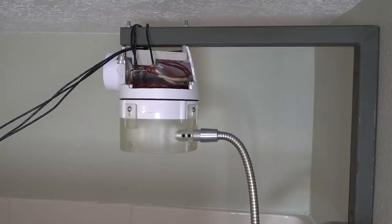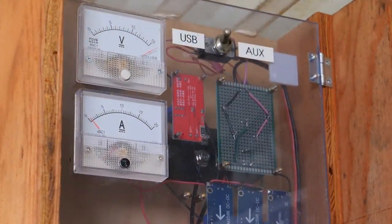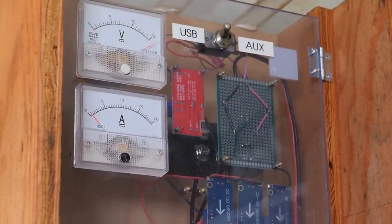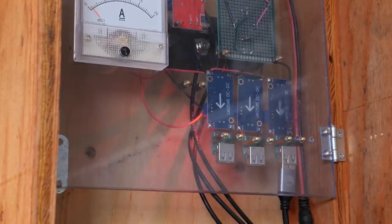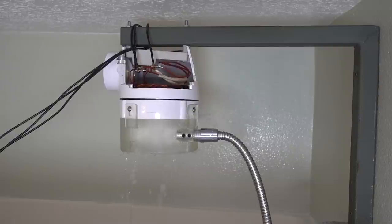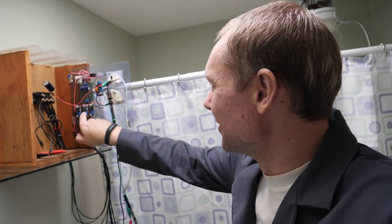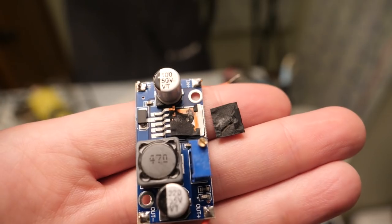Everything's set, so it's time to fire it up for the first time. As soon as the generator spins up, the voltage pegs out the gauge way above what the electronics are rated for. The red flash of light is at least one of the three voltage converters burning up. And while it still partially charges my phone, eventually something made an audible pop. I heard the pop and one of the voltage regulators blew apart. I hooked up my voltmeter — 65 volts. These voltage converters are only designed for a maximum of 35 volts going in.